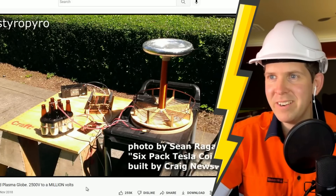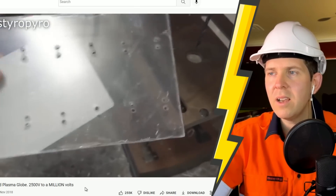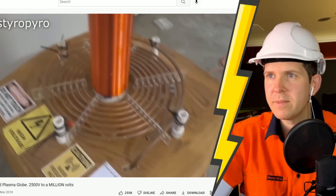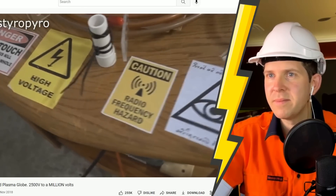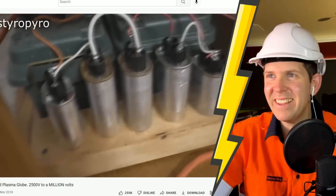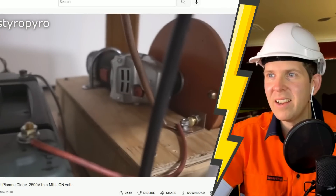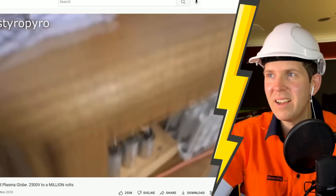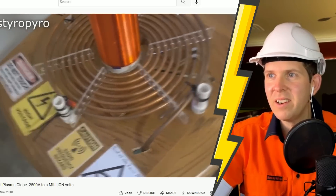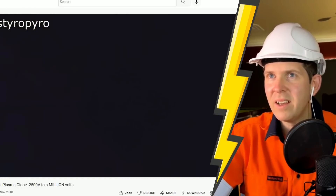I ended up meeting in the middle by building a bank of smaller pulse capacitors, which gives great performance at a much lower cost. Here is the completed driver - it definitely looks terrifying. I went ahead and added some warning stickers just to keep people safe. One thing I want to point out is I added 10 of these microwave oven capacitors to act as a capacitive ballast, and over here I have my spark gap mounted and there's my capacitor bank. So I guess we're right to try this thing out. Without the plasma globe on top, that way I can compare it to the original plasma globe driver.